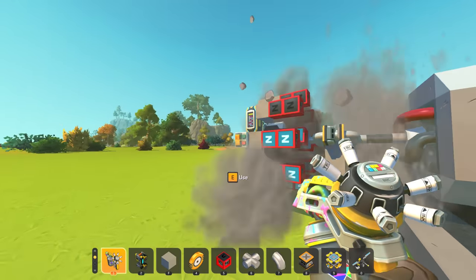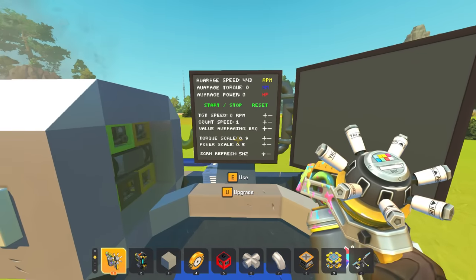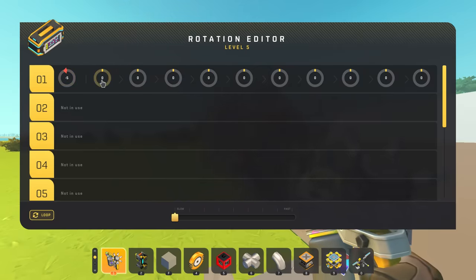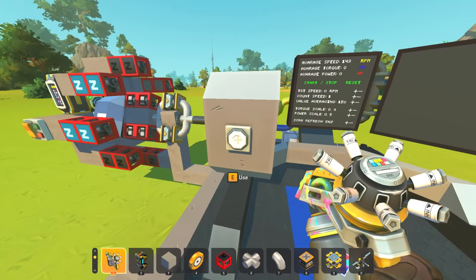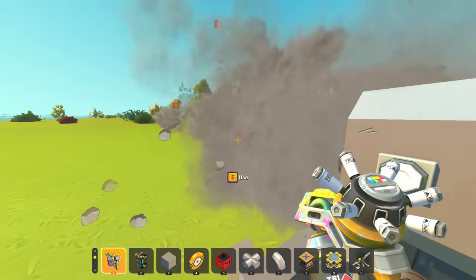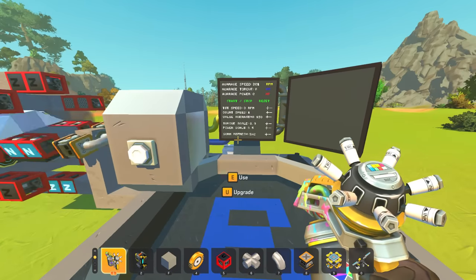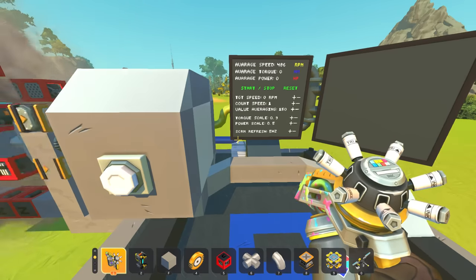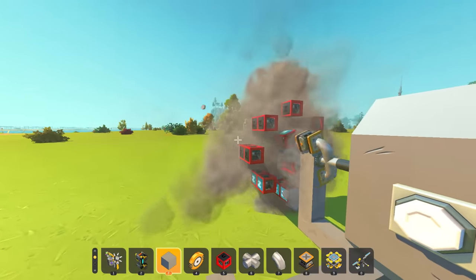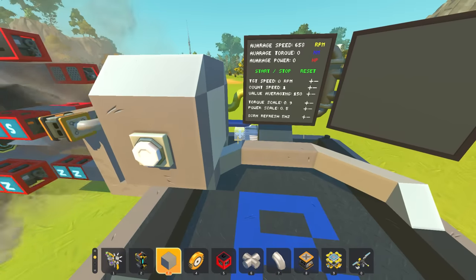Let's turn this off and set it to about 10 degrees, going down in five degree increments back towards zero to see if we get better speed. This one already goes up to 500. Let's go down another five degrees - that one went bad. Now it's noisy and banging everywhere. Zero is quiet - 550. I can't believe how cool this is - 700! There's got to be a sensor delay with a tick coming out. We're just checking RPM right now. I don't think the torque is going to make a difference - it's just based on number of magnets. This is 660.